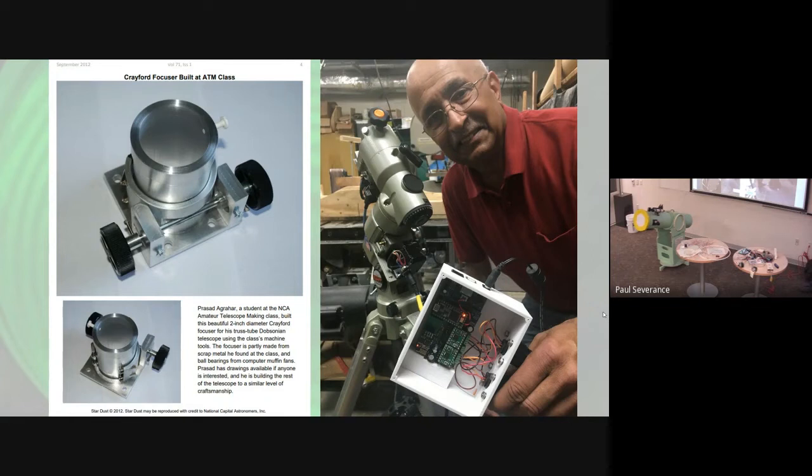No, it was not. And at the end, we were bailed out by a person in the audience, Arlen Rash. Thank you very, very much for your help in figuring out that, first of all, if you're going to have external stepper drivers, they have to be at a different voltage, 5 volts as opposed to 3.3, and a bunch of other things. So we have this here.